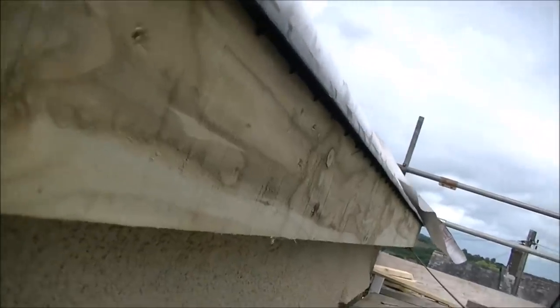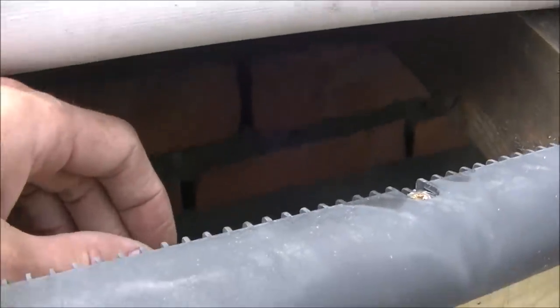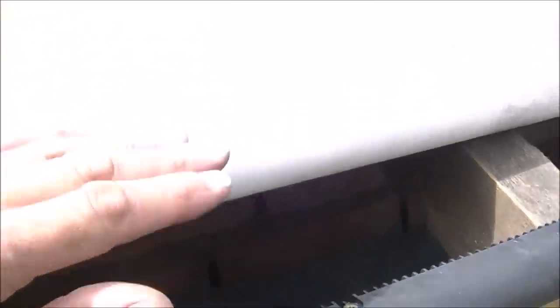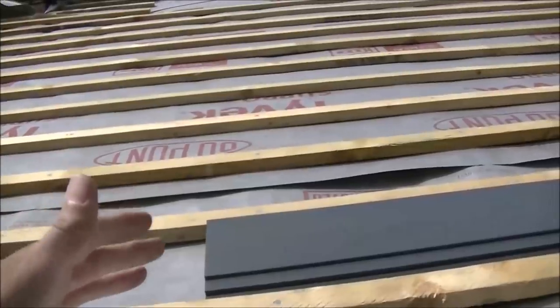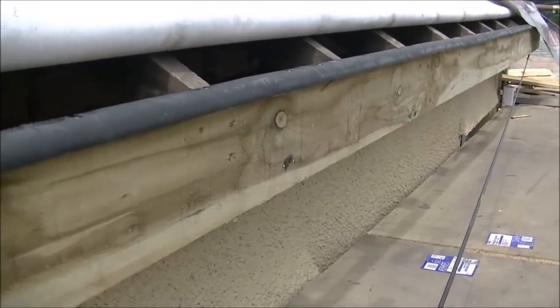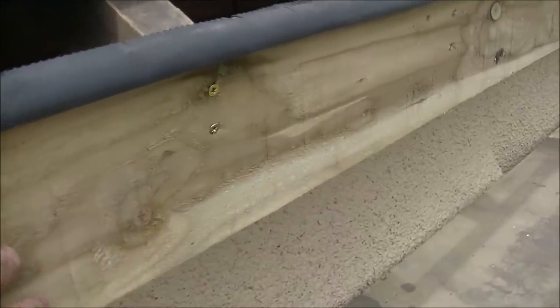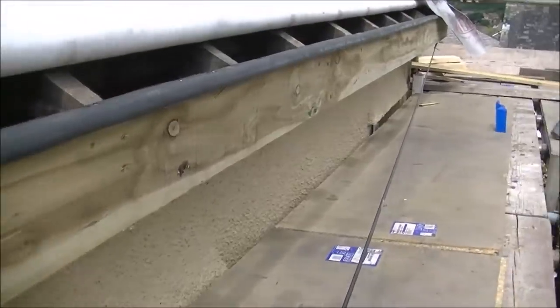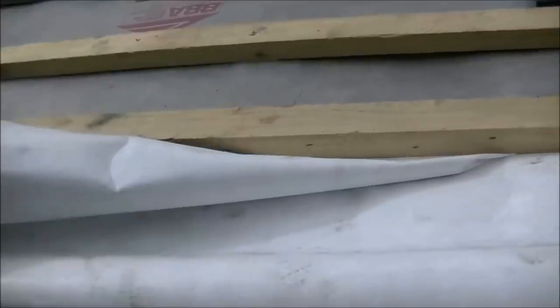A quick explanation of these vents: the air simply goes up into the vents, works its way through the grill at the back, and then goes up underneath your roof. There's a gap between your insulation board and your felt, and air can circulate up over the ridge board and back down the other side — so there's a constant flow of air. The fascia board is just gravel board because I'm actually going to cover this with a UPVC thin fascia over the top later, so this isn't the final finish. I've just used cheap treated timber for now, but I can get all this on and finish it with the UPVC at a later date. For now I just want to get this roof watertight and get it slated.